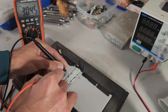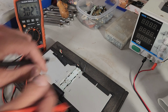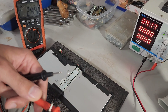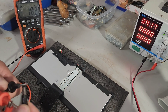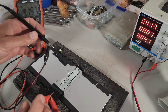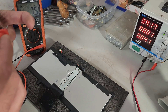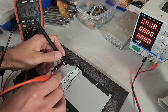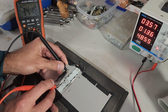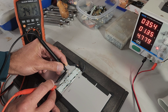I've already done a little bit of charging on these, so I got them up to 3 volts, but that still wasn't enough to register with the computer's charge controller. So we're going to turn on this bench power supply — I've got it set to about 4.2 volts and amp limited to about 1.3 amps, so we're not going to fry the battery with like 10 amps. We're just going to hold that and charge both of these little batteries with the bench power supply.